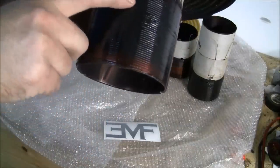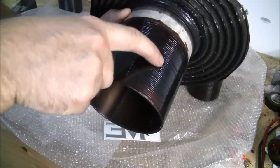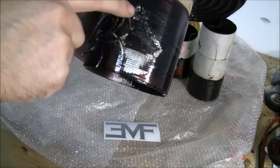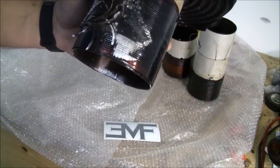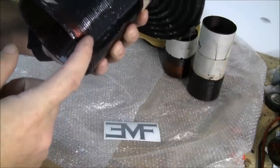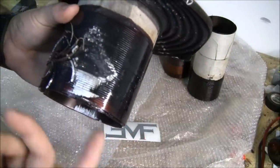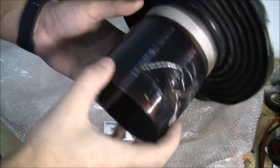You can tell it's uneven with some rippling, and there's rubbing — the coil broke loose and got knocked around in the gap, which is why it's all folded up. This one had some holes and was on a 6,000-watt amp that was clipped. When you blow a hole in it like that, that's from excessive current. This wire is not that big — we're talking 18-gauge or sometimes 20-gauge wire, and in some coils even 24-gauge or 28-gauge wire. There's only so much current these can take.